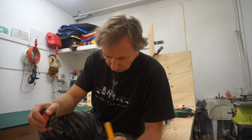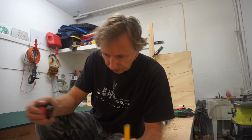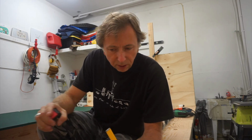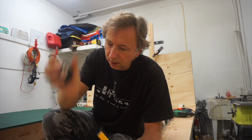All right, I think that's about got it. You saw me going back and forth, back and forth. It's weird sometimes, you move one side and it seems like the other side is off by a quarter inch. Sometimes it's just a little bit of a twist of the thing, but just take your time with it. Keep playing around with it until everything matches up. So I'm 23 in from each side till I hit a 2x4. And there's 26 inches between the 2x4s up top. There's 26 inches between the 2x4s at the bottom.